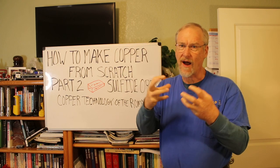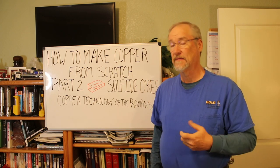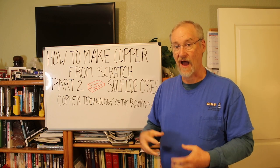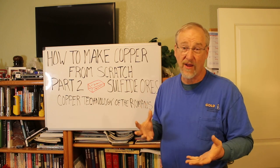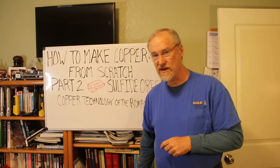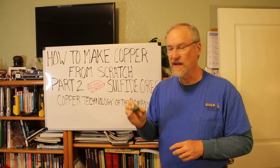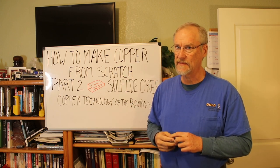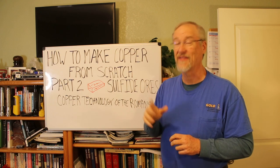But because those are products of air and water, once you get far enough down into the ground, eventually you get out of the zone where there's air near the surface. There's not air and oxygen in the center of the earth. So you get down anywhere from 50 to 100 to a couple hundred feet, depending on where you are, and you get out of that zone of oxide rocks, and you get into a zone of black and metallic yellow colored rocks that are heavy, but they're different from those blue ones. And it's not as easy to turn this rock into copper metal as it is with the other oxidized rock.